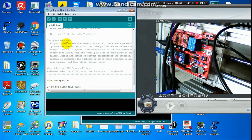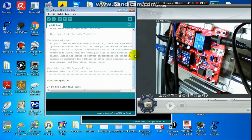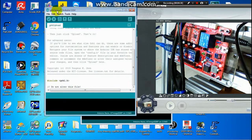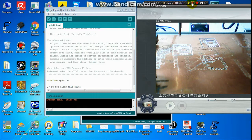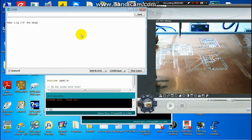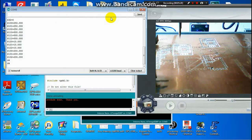Then finish — upload is done. I can show you now. I have one trick: you can check your connection. Click the Serial Monitor and you see GRBL. Set the baud rate to 115200. You can check the GRBL configuration using the command $$ — this shows the configuration in GRBL.